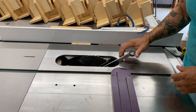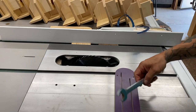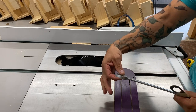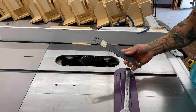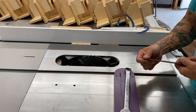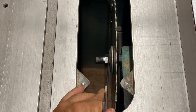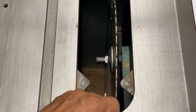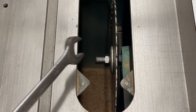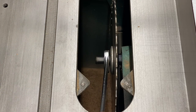Here's one way to tighten the blade — very easy. I like this type of wrench, not for the leverage. This could actually be shorter, but it's much more substantial — a lot wider. The ones that come with the saw are pretty weak and can even get caught between the nut and the washer because they're so thin. Here you can see how the factory wrench kind of gets caught between the nut and the washer, unless you're right on the hexagon part of the nut. This really only applies to the Unisaw or those types of cabinet saws; the SawStop seems to have substantial wrenches.